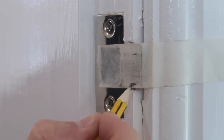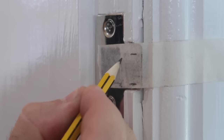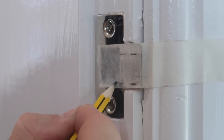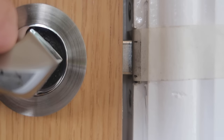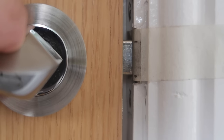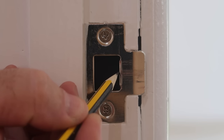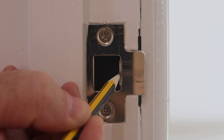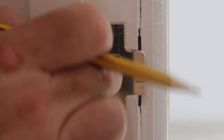On my door here, the bottom of the latch is worryingly close to the bottom of the hole, but probably just high enough to fit in. Looking closely at the latch as the door is closed, I can see that it's semi-latching and going slightly into the receiving hole, but not enough to really catch properly. It looks like it's starting to run around the radius but not far enough to securely click into the hole. I'm also worried about it touching the bottom section, which is a common problem with doors that have started to fall.